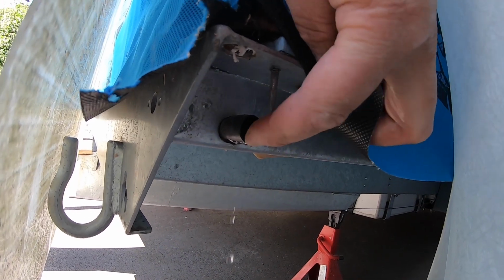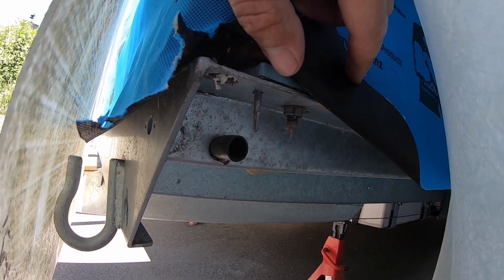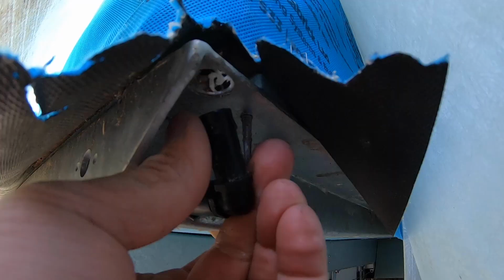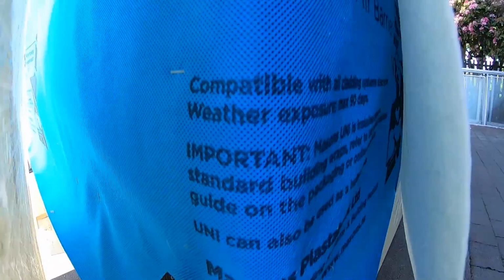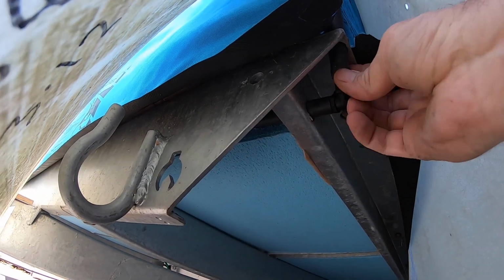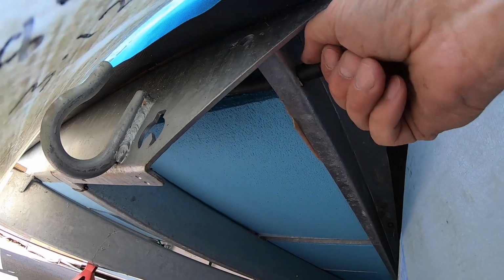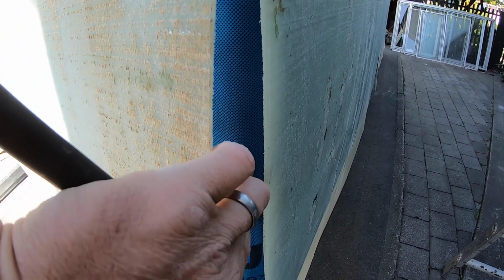Before I get too carried away, this is the grey water breather, which needs to vent out up near the top, by the roof. So we've got this little elbow, put that in. The elbow's in, and then you'll just see a hole in the chassis there that I've drilled. And then we're just going to run it up inside the cladding, but then it's going to poke out just at the top there. You need to vent them out near the top so you don't get the smell wafting back into the cabin itself, or as you're walking past. Nothing worse than grey water smell while you're camping. I actually took the corner off the stud that runs up there, so there's a little flat spot there for it to sit against.